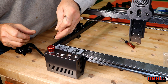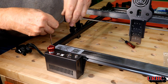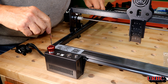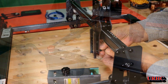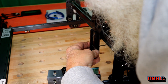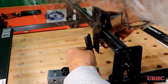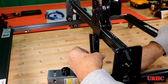You slide it to the front and they use a screw to tension it. I really don't like what they did here — you get a little nut you turn sideways and then the tip of the screw hits the belt, but the minute you start to tighten it, it twists the belt and tries to pull it sideways. You can't really tighten it that tight. It should have had some kind of plate on it to stop that. Then according to the instructions you move the laser mount down, which is pretty easy with just two screws.